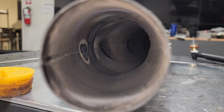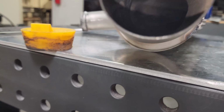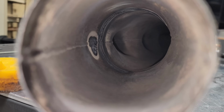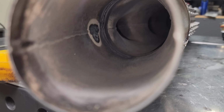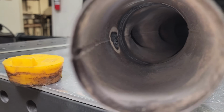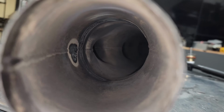Now, it is colorless, and that smoke that's coming out, man, that stuff. There's no color on there, but you can see there's a lot of garbage floating into it. Not to be confused with the piece that's next to it. That's that plug weld that the previous welder did. So a lot of garbage, but it's full pen, it should hold.